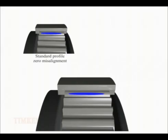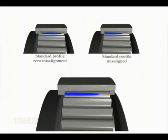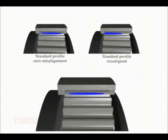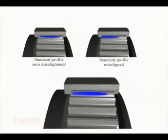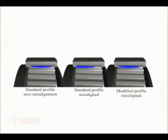However, some misalignment is normally present. Designers, therefore, apply profiling to gear faces that accommodates loading and misalignment, as well as helps to ensure that complete contact with the available face can be reestablished.